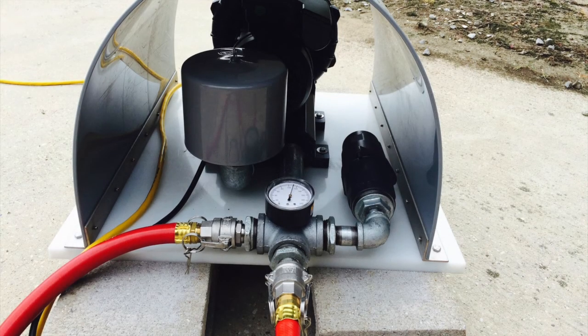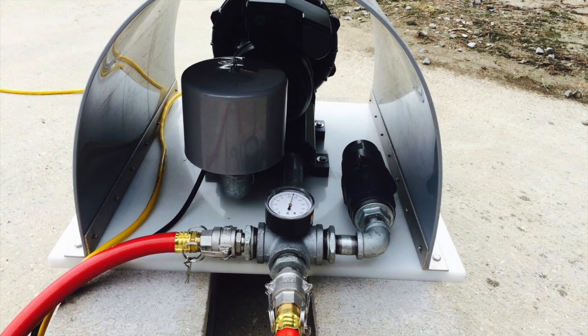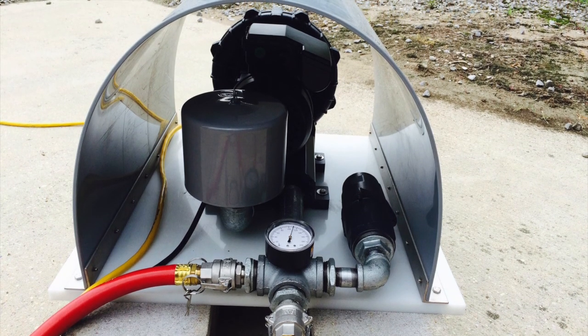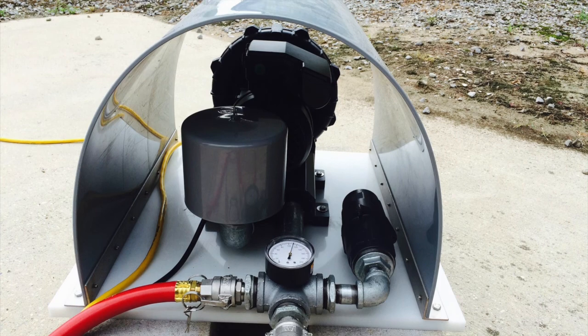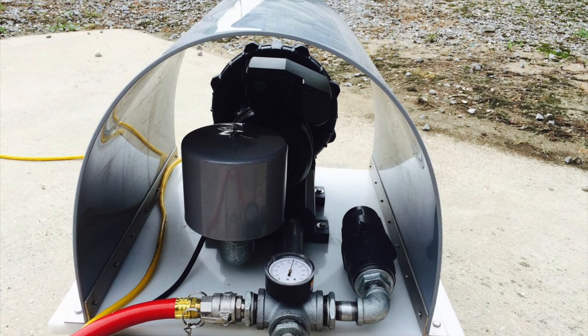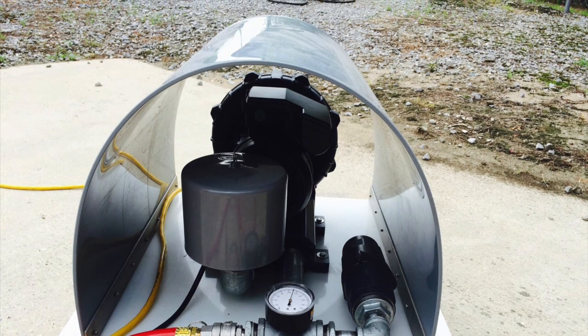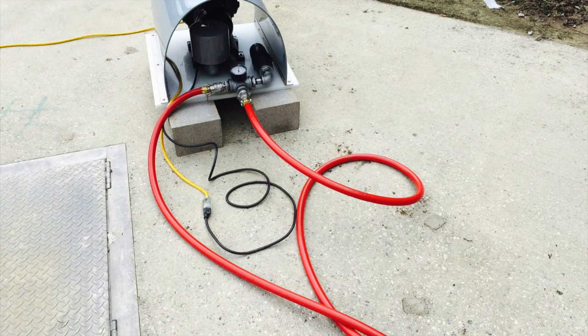The installation of the Wet Well Wizard is simple and can normally be accomplished within 45 minutes. The blower will be purchased either with or without a cover. There is an open-ended cover shown, but there is also a closed, vented fiberglass cover and locking boxes that will allow for total weather and dust protection and sound suppression. Without the sound suppressing cover, the blower emits only 68 decibels.